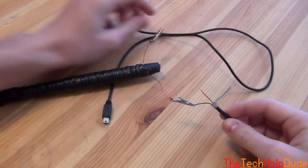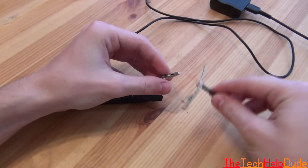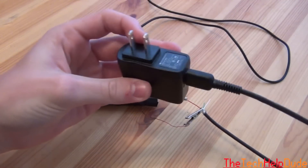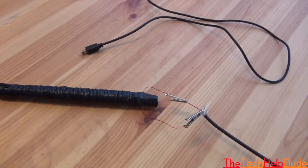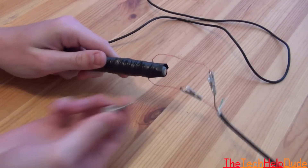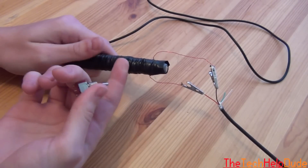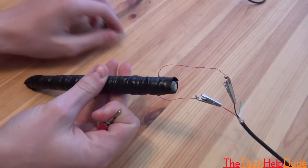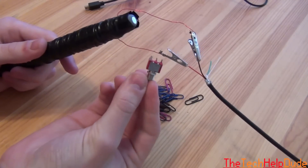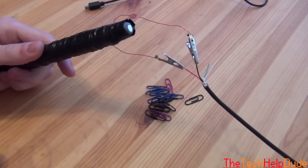Make sure it's not plugged in when you're hooking this up — make sure it's unplugged so you don't electrocute yourself. Go ahead, connect both ends, and then you can plug it in — into your computer or with a converter directly into the wall. Right now our electromagnet is alive. On my other version I had a small switch, which is totally optional — it allows it to turn on and off. You can put a switch between the electromagnet and the wire so when you switch it, it lets the current through.